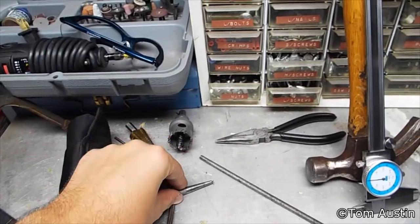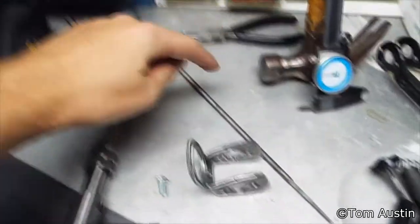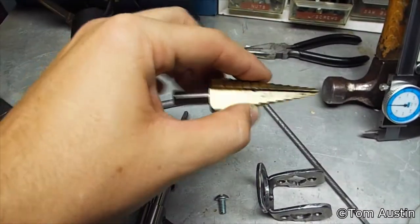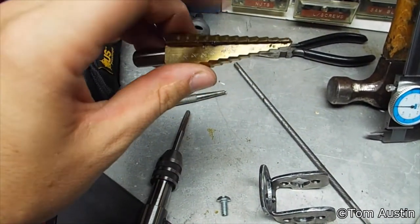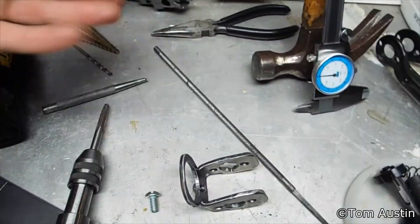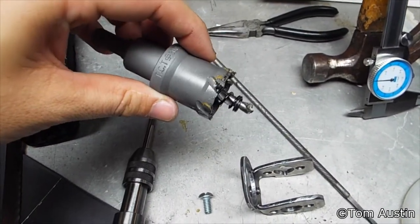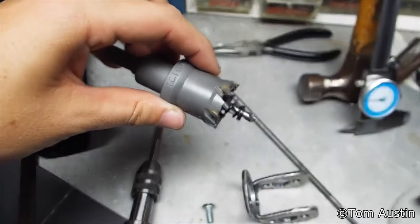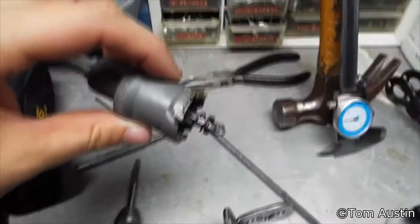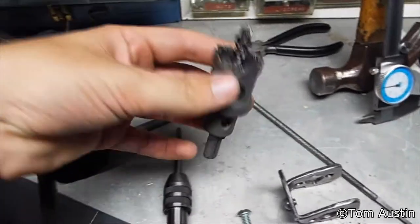You're going to need a nail punch, a set of fine files or at least a 3/16 round metal file, a step bit that has at least ¼ and 5/8 on it, a 1/8-inch standard HSS bit, and a 30mm or 1 and 3/16 tungsten carbide hole cutter. This is specifically designed for cutting stainless steel. You might get away with a cheaper one for hot rolled, but this was $9 from China, so might as well pay the extra buck for a stainless steel one.